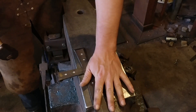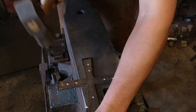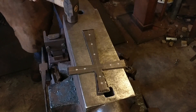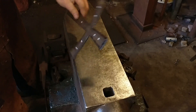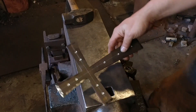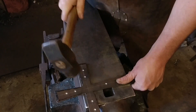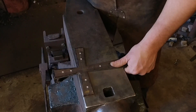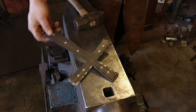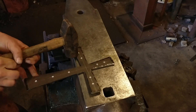We chose two different ways of doing this — you can mix and match to give them some dimension. There's more of a bladed or banked look — you can do whatever makes you feel good. Just work the different angles of your anvil, whatever works for you. Those corners are probably the hardest portion. Just like that — you repeat this on all sides. I just want to point out this is all still done cold; there hasn't been no heat change or anything here.